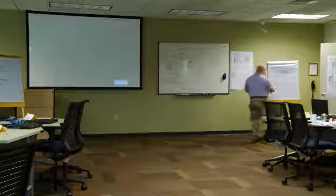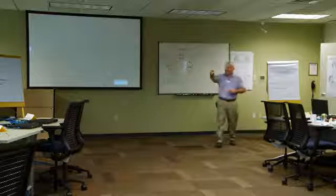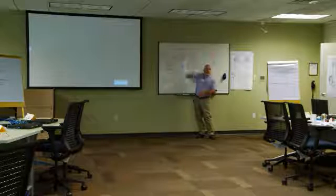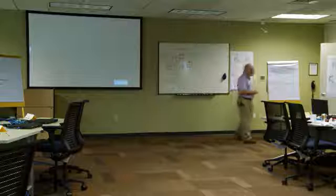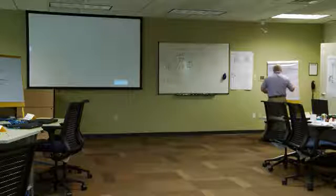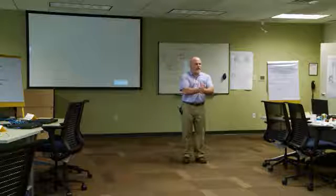So I'm going to write your answer down, but I'm going to write it down here. And I'm just going to write by grounding. Okay? But what's the other reason why we mentioned there? Dave? It allows the other equipment, like the breaker or whatever device you have set up, to work like you're supposed to work. Exactly. We want these things to operate as fast as they can. And that, in turn, will actually help our first reason, right? Protect personnel. So we're going to just, right here, help things operate. Okay. Any questions on anything we covered? Anything at all? If not, we'll take a break and pick it up later.